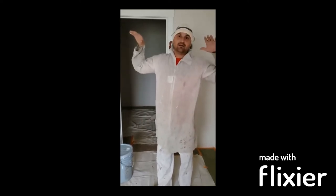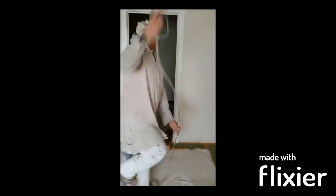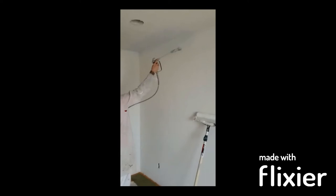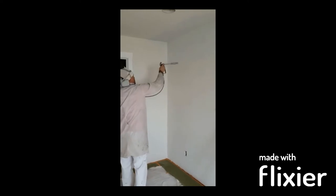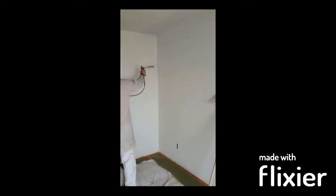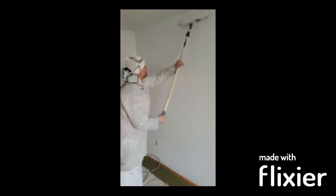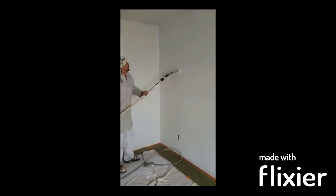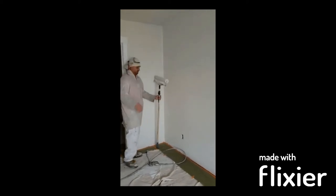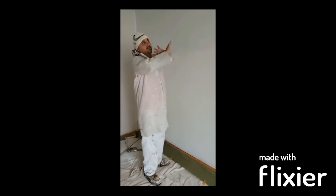The day after that we're going to come back, we'll start cutting in and roll it on the wall by hand. So I'm going to give you a little demonstration - I'm going to go out and spray this wall. I'm going to start at the top, 50% overlap on the left, take it all the way down. Then we're going to go back with our roller and roll it - we want to make sure that it's in there, applied, sealed. That's the purpose of this: to seal everything, all consistency.